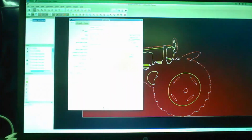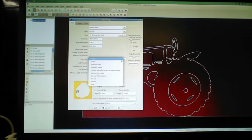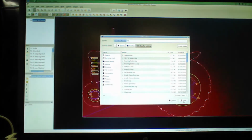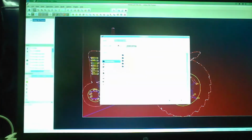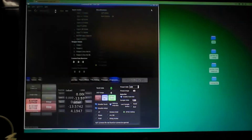We're looking it over. We're going to do a jet cutting toolpath. We're going to do an inside offset on our layer underscore one, and everything else is preset for the thickness of our steel. We're running a 45 amp plasma cutter, and I think it's 22 gauge steel. Very thin stuff, just for light duty. We use it for making signs here at the shop.